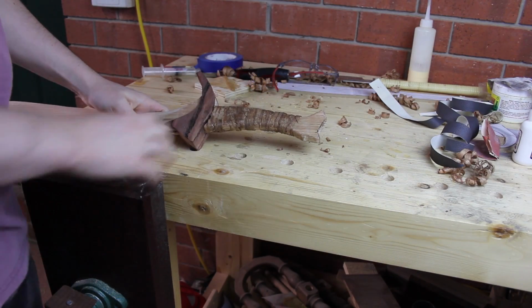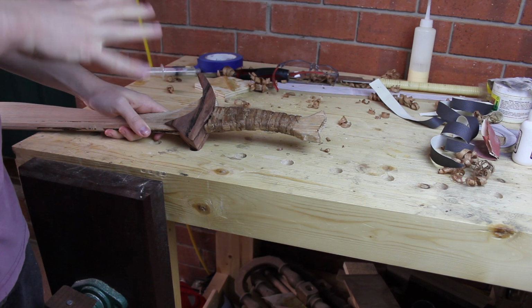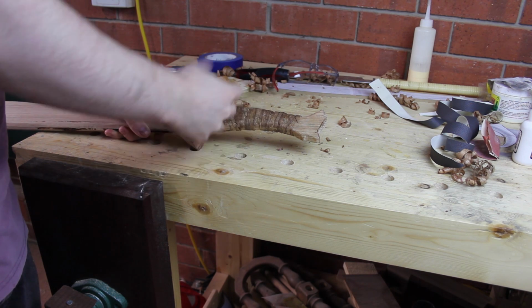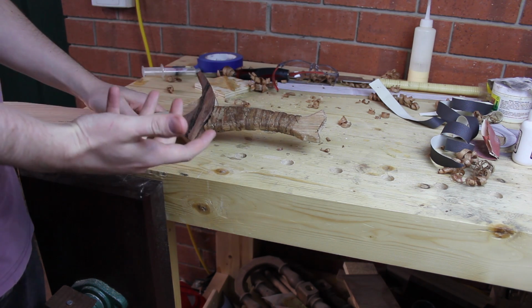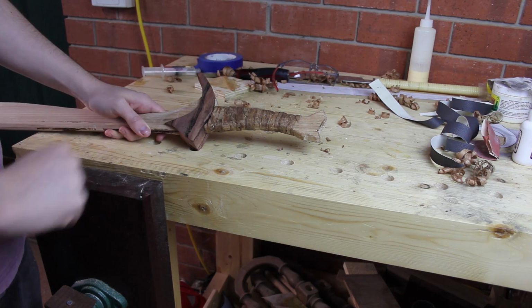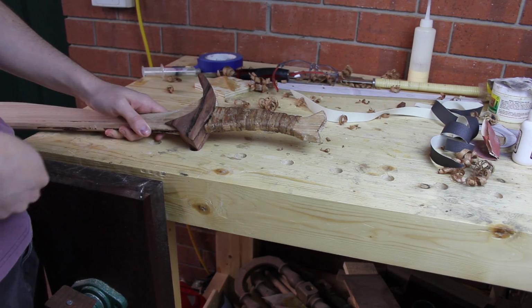The original idea was that the blackwood shavings would make a leather-like wrap around the handle. Unfortunately, the shavings had a tendency to crumble or crack or split. And I think being so thin, they didn't quite work out too well. I couldn't get first the CA or then the epoxy to quite grab successfully without pulling itself apart. So the end result was pretty crappy. So what I'm going to do is get these grey vinyl strips and wrap that around like you would with leather.